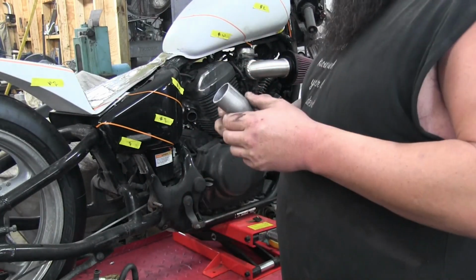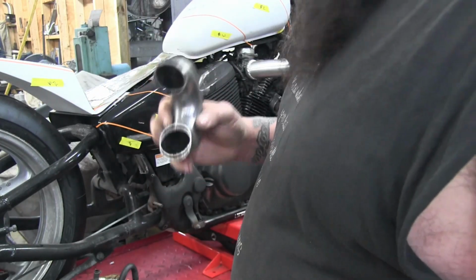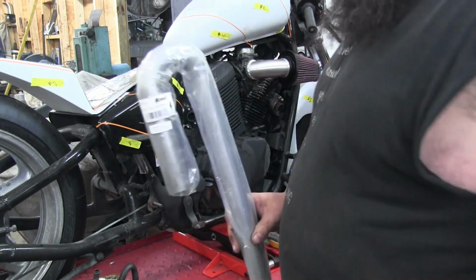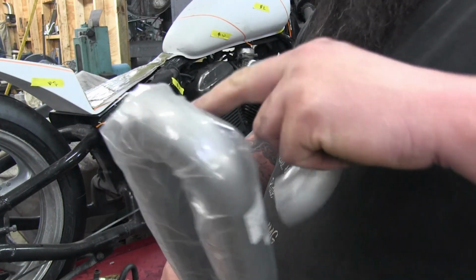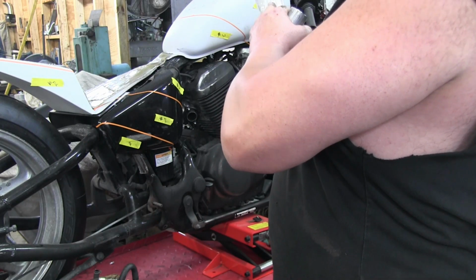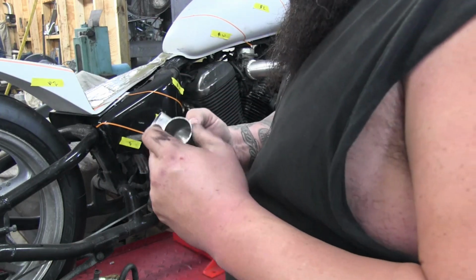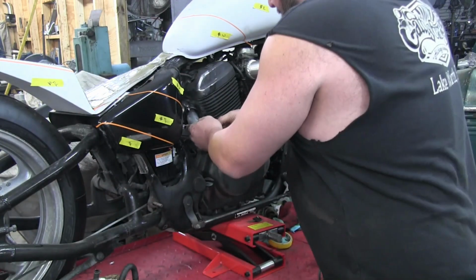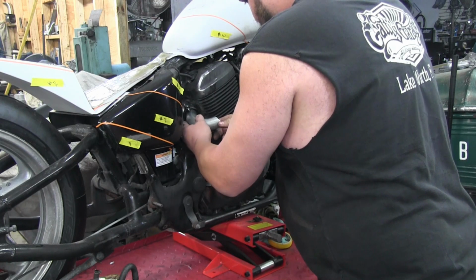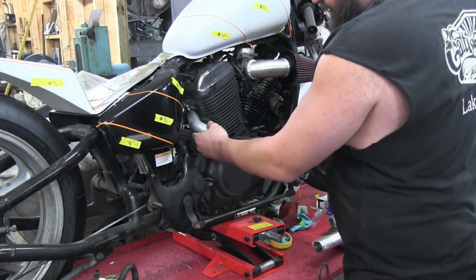All right, so quick update redo. The exhaust donut is the 1¾". That's the second step. My brain is not working great today. So we have, these are regular J-bends, 1½" tight radius. I believe it's a, it doesn't say, but I believe it's a 2½" radius, which is the tightest you can get in a J-bend. And this is gonna be our first step, which will fit here onto our stock flange.